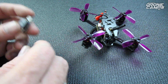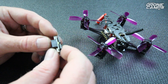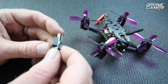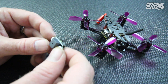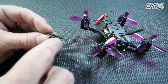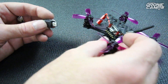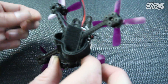What I thought was cool about this quad is that it comes with a buzzer and LEDs on the back. My only beef is that when I was out flying it, mine started falling off — it shifted a little and got hit by a prop. I had to rip the whole thing off to continue my flight test. What you want to do is take a little piece of VHB tape and put it underneath. You don't have to disconnect the wires — just sit it back down, make sure it's snug and not touching your props. There is actually a little slot right back there where it plugs in.